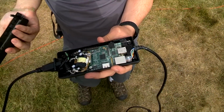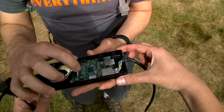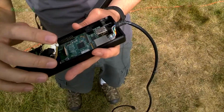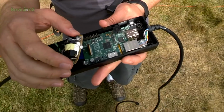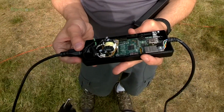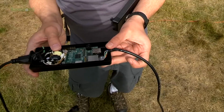Oh, there's a Raspberry Pi inside. That's fantastic. I love this case. Yeah, it's so covert. I actually had to desolder the S-video out of there just to fit it into the case. You don't need the video anyway. And then here's a USB power supply that's just taken apart so it fit. Like your iPhone charger or something like that. Exactly. And then the power cord is the same after that, and an Ethernet cable on this end.